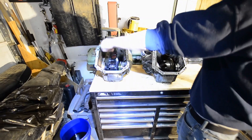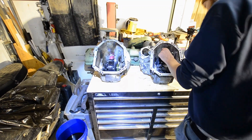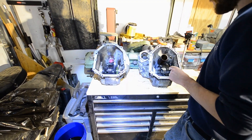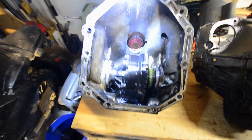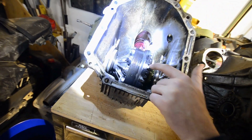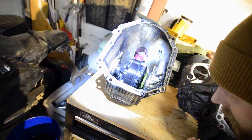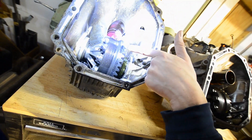The pattern is the same, right? These were definitely physically made up here and it looks like the seal tube is probably the same. But if you look over here, the bell housing is definitely different. It's kind of amazing really - like that one ran without oil. And presumably this one ran with oil. It doesn't look that different. This one's obviously a little chewed up - you can see the edges are maybe just a little bit rounded over. And you can see where the gears were contacting and where they weren't - that black patch is probably where the gears were not contacting, and the shinier section is where they were, which is actually pretty similar to the depth of engagement on this one too.